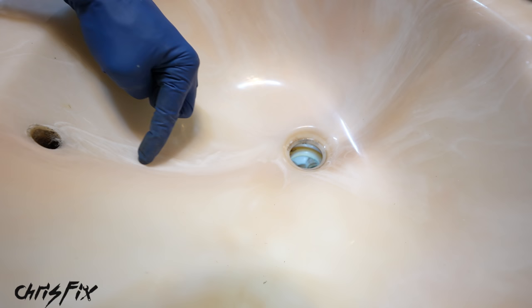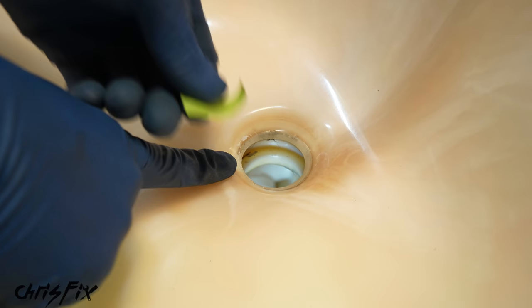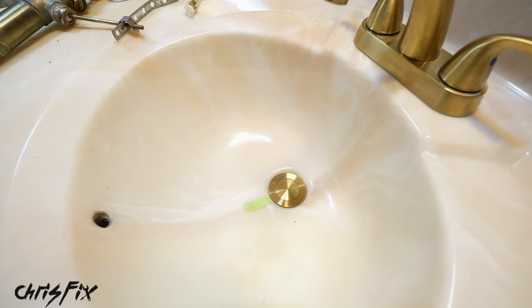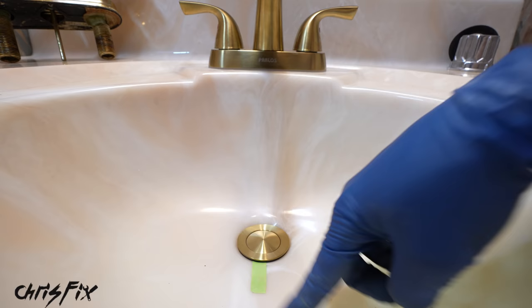The emergency drain drains straight down into a hole — I can feel it with my finger but you can't see it easily, so I'm using a mirror for a better look. You can see the hole in the mirror right where my finger is. I'm going to put a piece of tape there to help visualize the install. Our new drain also has a hole in it, so when it goes in we have to align that hole with the sink hole so our emergency drain can drain water even when the stopper is closed. With the drain hole aligned, that's all there is to it.